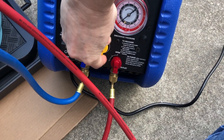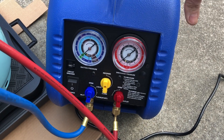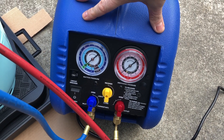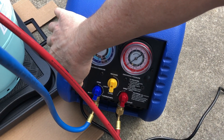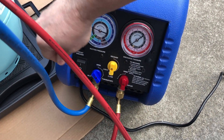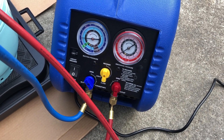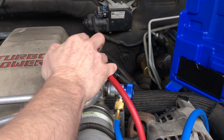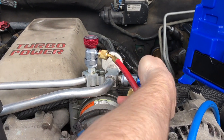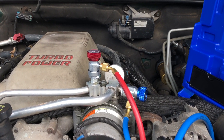We're at zero here and zero down here. We're going to turn the machine off and turn it to the purge setting, which is going to get any residual refrigerant that might be inside the system itself. It might be too low of pressure for that to go, but the manual does say that if you have that kind of problem you can turn it to the purge position and that'll let it go. While it's purging we're going to go ahead and close off our valves up here. Once it finishes this purge cycle we will be done — it'll shut itself off automatically.